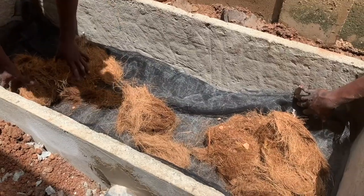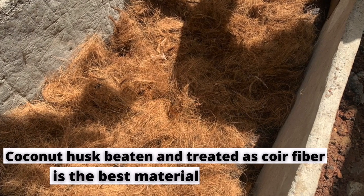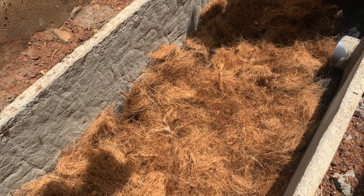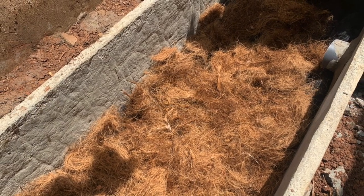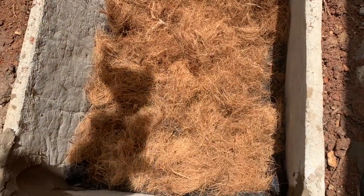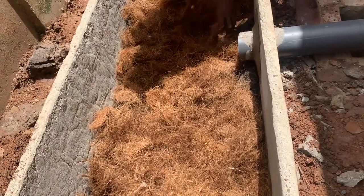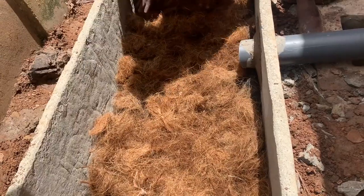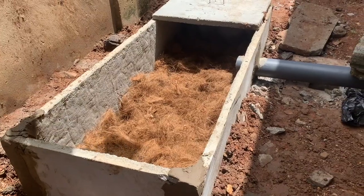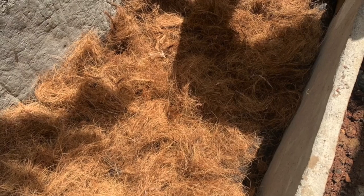After the fiber net, cover it with treated coconut fiber. This is what treats the human waste — it generates microorganisms that feed on the feces and eliminates the scent and smell associated with human waste. The wastewater is taken out and the feces remains in the digester to biodegrade. Make sure the coconut husk is evenly spread across all corners of the biodigester bed so it can handle any human waste that comes in.